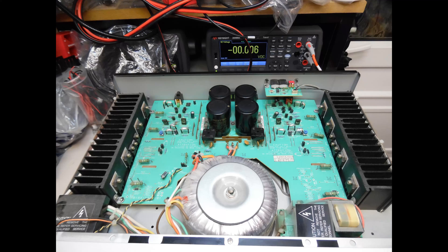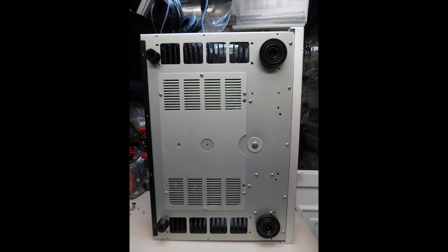I received the amplifier and did the initial investigation. I want to bring to your attention this photograph showing a service plate, which is very common on amplifiers of this era. When undertaking the repair of a single board design like this one, that service plate doesn't give you full access to the entire circuit board. If you're going to disassemble this amplifier, you've got four fixing screws through each of the heat sinks, and then a single grounding screw which connects to a grounding terminal on the main board.